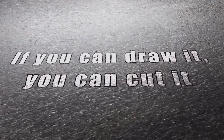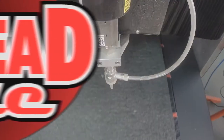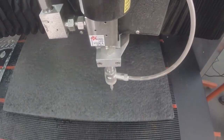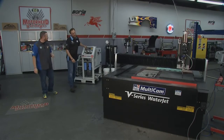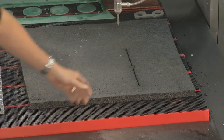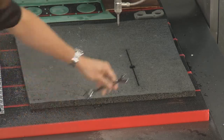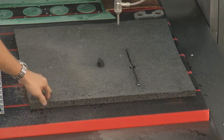So we have aluminum, we have our gasket material, and now the foam. I want to see the foam because to me that's going to be the craziest thing this thing cuts — the stuff's so sensitive. We've seen aluminum, now the foam. You told me to grab a wrench, and I'm trying to figure out what we're actually cutting over here. Man, that was very quick. You had me grab that wrench because a lot of times in your toolbox you want to have some kind of a foam insert. Well, here you go — it can go right in there, just like that. When cutting foam you don't need abrasive, it's just water only. You have full control at your workstation whether you want to use abrasive or not. When you're cutting something thick or hard, you're going to use abrasive. When you're cutting something as soft as foam, water only.